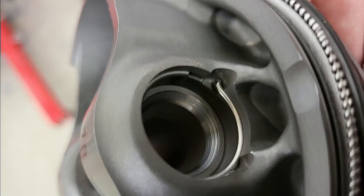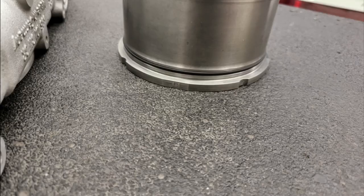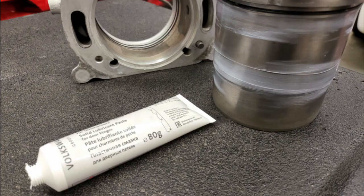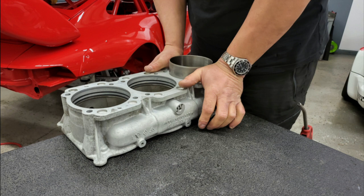The outside circlip is fitted on pistons 1 and 3. For each liner there are three o-rings. Two of these are fitted into the liner holder which go to the top, as you can see in this photo, and the other one fits onto the liner as you can see here. Special grease is then applied to the liner and also into the liner holder. Then just by pressing down onto it on a flat surface the liner for number three and number one are fitted.